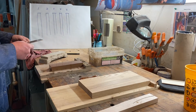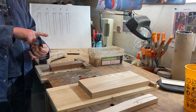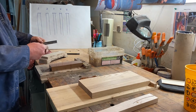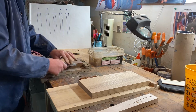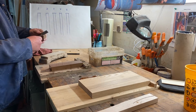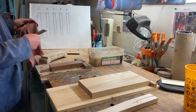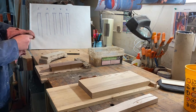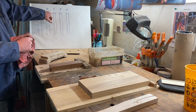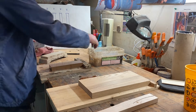All right, so at this point, there is no area being protruded proud of the edges of the scraper, and I flattened all four of the surfaces that you would typically sharpen for scrapers. Now I sharpened it better. All right, so I have this. Now what I need to do is create new surface, or new horns, onto this scraper for doing the cutting. With nothing present here and here, I need to recreate these things. It's kind of similar to what we have here, but I need more surface area on these little horns. So with the sharpening stone, I'm going to do just that.